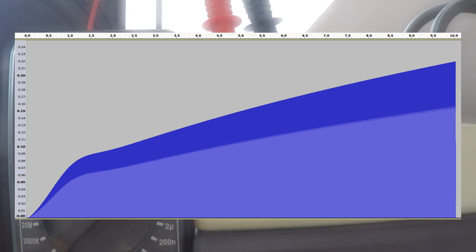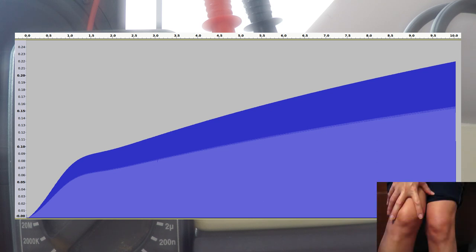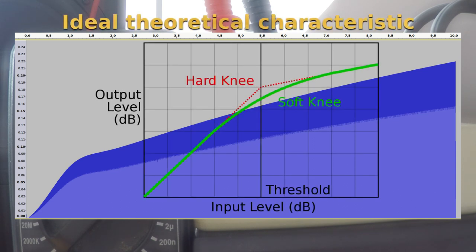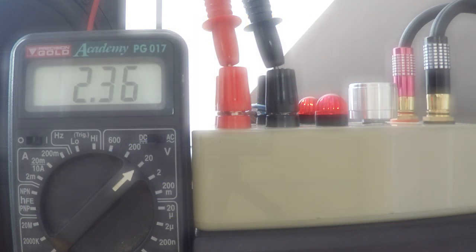This looks almost ideal to my eyes, although you may spot an ever so slight dip in the curve around the 2 second mark. From 0 to 1 seconds, you can see the constant rise of the test signal before the action of the compressor begins. This is followed by, in my opinion, a lovely soft knee from 1 to 2 seconds. You can see how the gain reduction increases after this point, as the rate of rise is far less steep than it was from 0 to 1 seconds. This, fortuitously, is an ideal characteristic that we would want to see in a high-quality compressor.